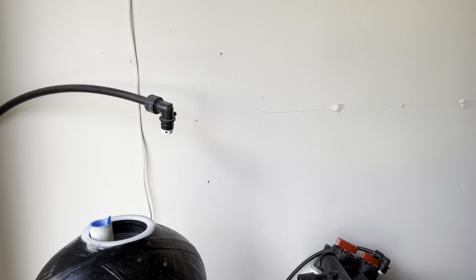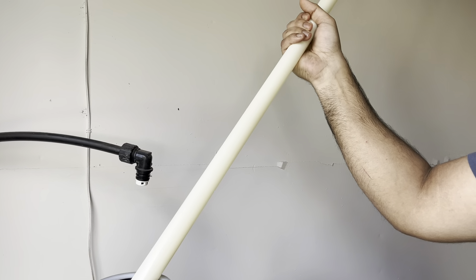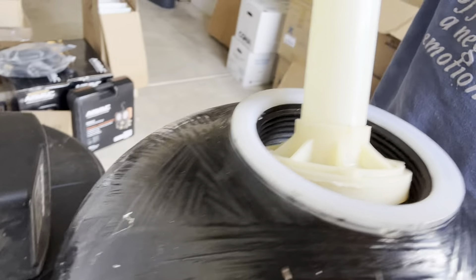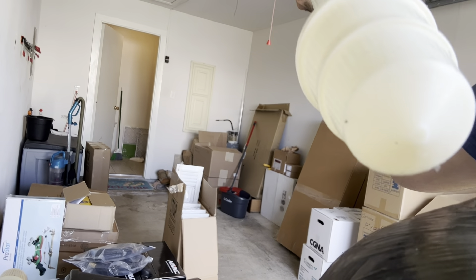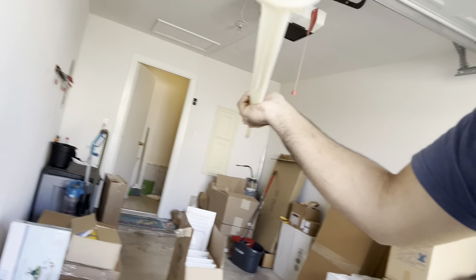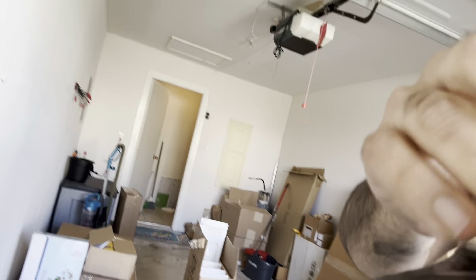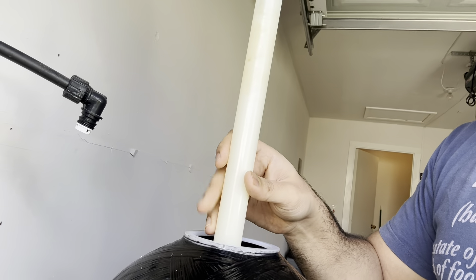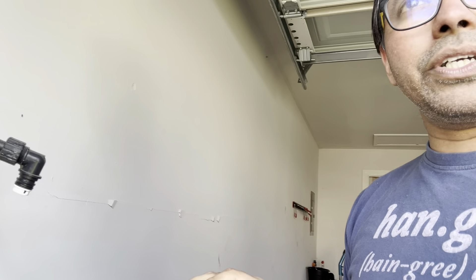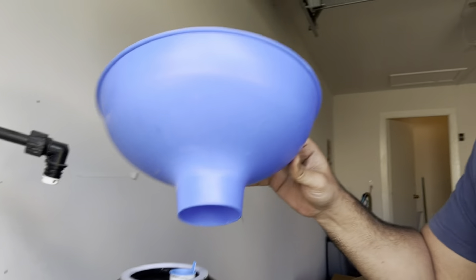This is the pipe that stays with your water softener — you don't have to order a new one. Just inspect it. There's a filter on it — make sure it's not broken, and if it's not you can reuse it. If you feel uncomfortable, you can buy a new one. The issue I had with this water softener was the water was coming out colored, so I figured the resin wasn't right. Resin replacement depends on how much soft water you use, how big your family is, and how many years it's been. This softener came with the house so it could have been lying around for many years.